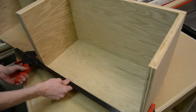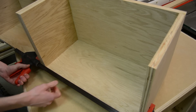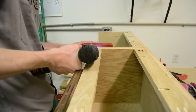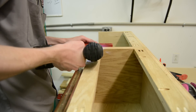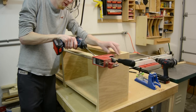I used a squeeze clamp to help pull the sides in on the cabinet to make sure that once I glued and nailed these in place it would pull the cabinet square. I also added some simple cleats to the top insides of the cabinets to be able to attach the top with, and I just used pocket screws to attach these.